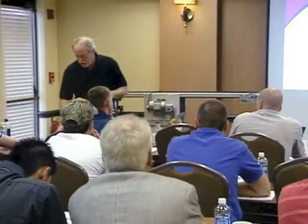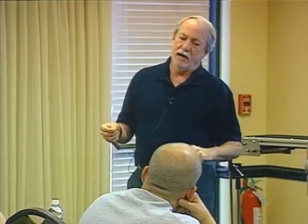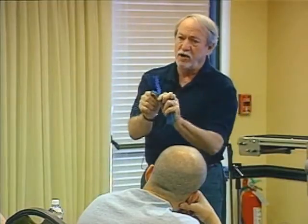There is another one that I would put in that category, and I'll send some of this stuff around, that would, in my mind, be quick splice as well. But it is unsupported. In the industry, we've always called them stretchy belts. The belts stretch. They're meant to stretch, and those are put on systems that have common shafts without take-up. So you would cut the belt short, put it on, and you wouldn't need exact dimensions to be able to run them on the same shaft, because they stretch on and conform to the size and the shaft. We call them stretchy belts.